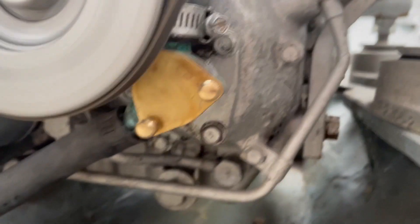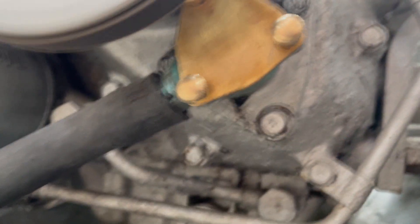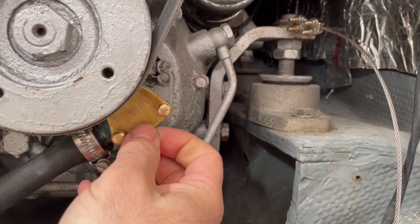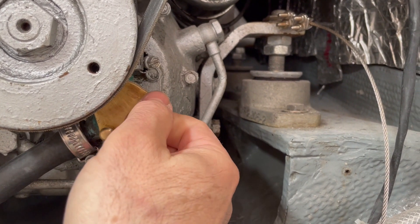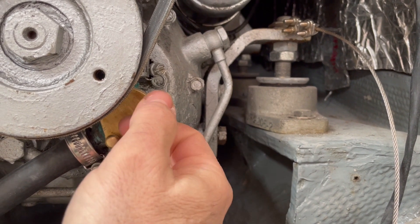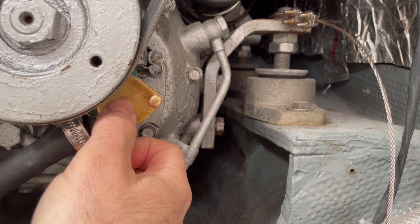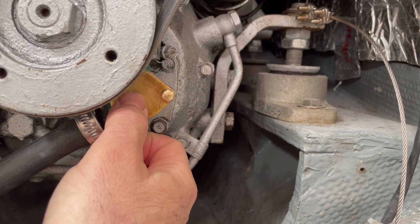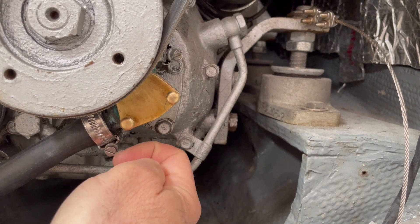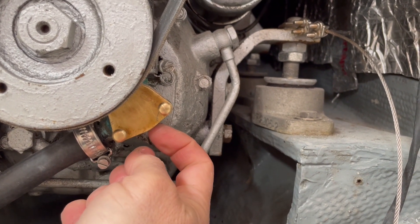You can see me running the engine here with no issues — I didn't even have the clamp on the hose, and here's the water shooting out of the transom. The object of this modification is to be able to quickly check the impeller when necessary, just unscrew and screw back down. If the cardboard gasket turns out to be a problem, I made several more, plus one out of neoprene to test further. But otherwise, this was a very worthwhile modification.